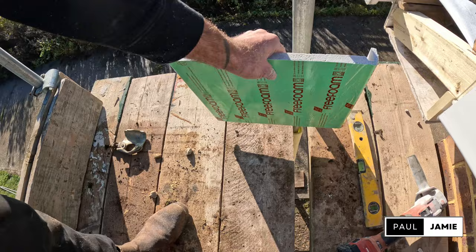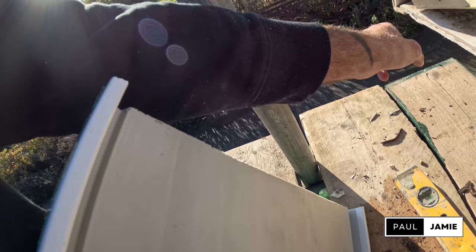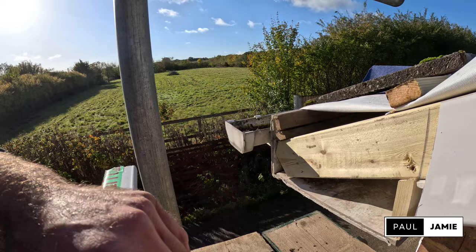If you cut it with a skill saw, you can cut it on the back and it won't splinter out the front. You can use a jigsaw, a multi-tool — cuts it nice. Even a grinder with a thin diamond disc for cutting porcelain, or a metal blade. So yeah, a couple of different ways of doing it. Notch that corner out, notch that corner out there — it's going to rebate into this corner, same on this one. So I'm going to notch that corner out now and then show you how to mark the top.